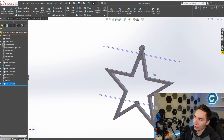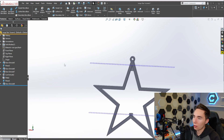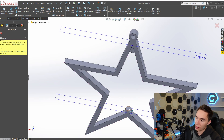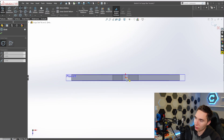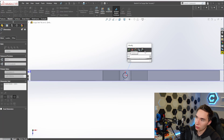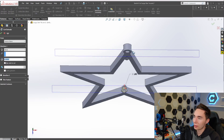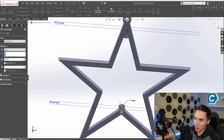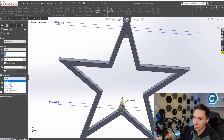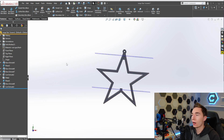We have the top hole for hanging it on the tree and some upper geometry done to hold the dowel in place. Now we make a hole that goes through. We start a sketch on top of the cylinder, making it just over a quarter inch - 0.260 - to give it ten-thousandths clearance so the dowel has room to fit and isn't too tight a shove. We make it go down into the star a quarter of an inch so it has somewhere to sit with some hot glue, and the other direction goes through all - all the way through - because we need to drop the dowel in from the top all the way down. That's the first star done.